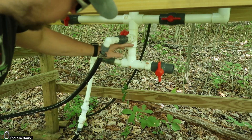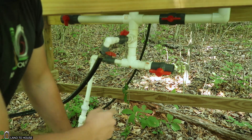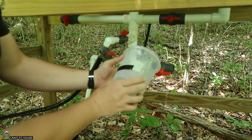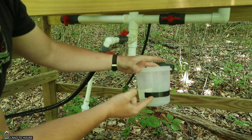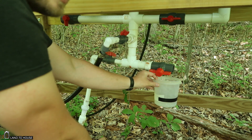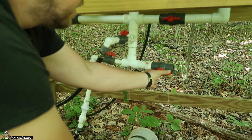We're up here at the storage tanks. There's a little bit of water right in here — I'm going to go ahead and open this valve and drain that. The water you're seeing here is coming up from the ram pump. I'm going to use this tub with some tape on it, and I'm going to time how long it takes to fill to the bottom of this black tape. As you can see, that flow rate is not the best. We're going to call that at 35 seconds.